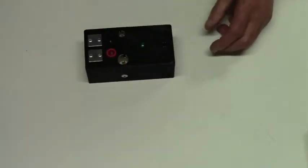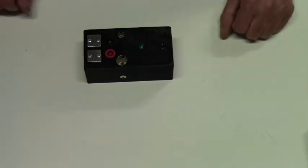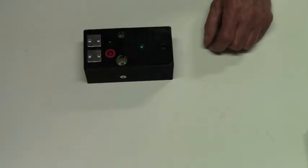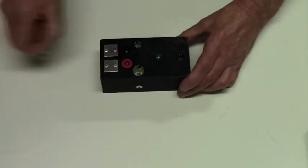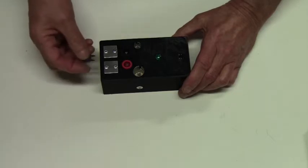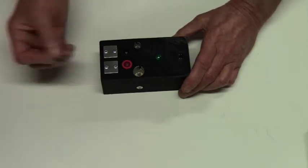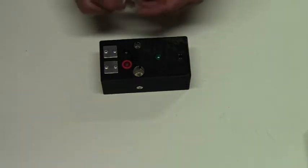This is just the fuse tester right here. You can use it on anything that conducts electricity and test your fuses — it doesn't matter what they are, fast blow, slow blow, whatever. Just bridge them across those two pads. GMA fuses, small ones, just bridge them across. You can test automotive fuses too; those you can pretty much tell visually, but if you have any question you can test it.